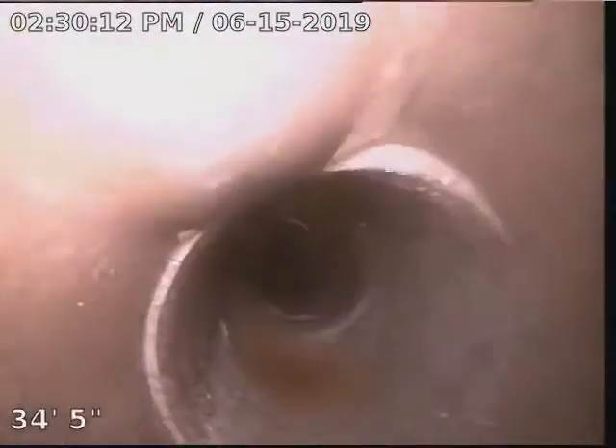That does not look good — what's going on. Okay, so all that water that's in there, that whole bottom of that pipe just crawled out. So if you were to do a liner in there, he's still going to be left with the same outcome. It'll be smooth, or won't be 100% smooth, but he'll still have these issues, so it wouldn't do anything to line it personally. On the outside, we'll just run it through and double-check everything. On that joint right there, you got a little slipping going on — it'll progress over time. Is that the clay? Mm-hmm.